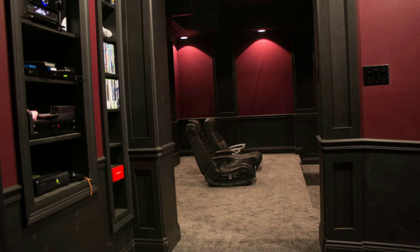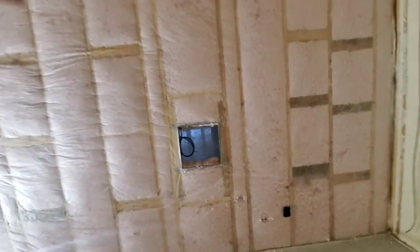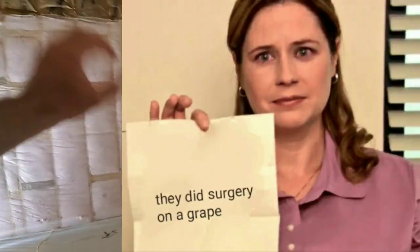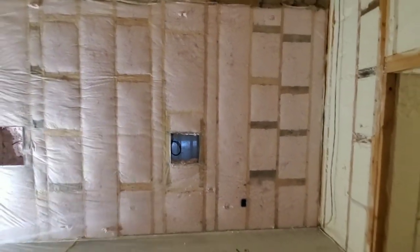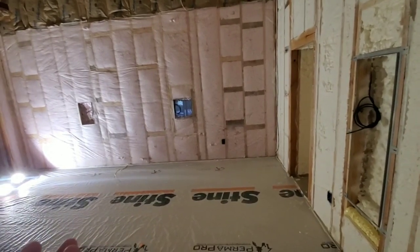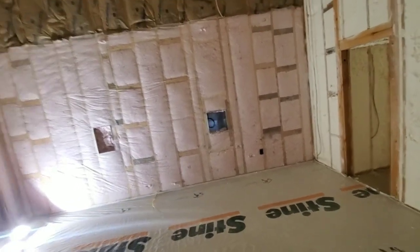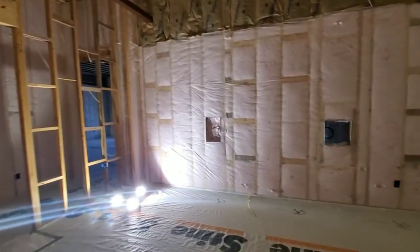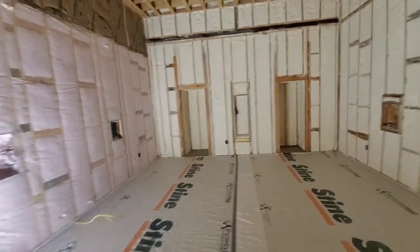All the acoustic panels, all the paint, the columns — everything in the room. The star field and carpet I did later, but take those out and it was three weeks. The problem with the old method: if you want to change a speaker, you may have to pull columns and trim out — it's minor surgery. With the fabric track system you just pull the fabric out and reinstall it. If you don't like the color you can change it. When you factor in the installation time and the long-term benefits, it makes a lot of sense and the price really isn't that bad. You're going to see it installed here and kind of get a timeline for how fast this room goes together.